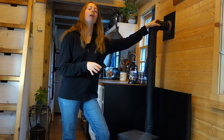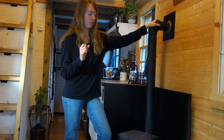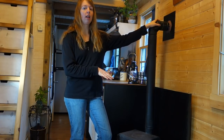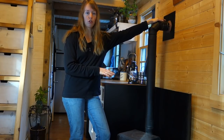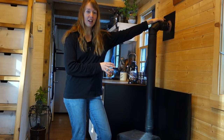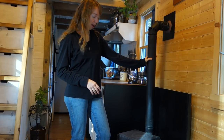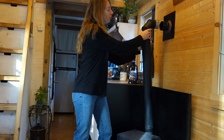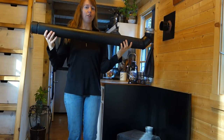The chimney does cool fairly rapidly even with insulated pipe. Between softwoods, which don't burn quite as hot, and some rapid cooling where I go through the wall, I do get some creosote. So about once a month, I check this and clean it out. The advantage compared to a big house is this is pretty easy to do — what I actually do is pull my pipe apart. I wiggle this joint here, it comes loose, and I can lift this off the top of my stove.